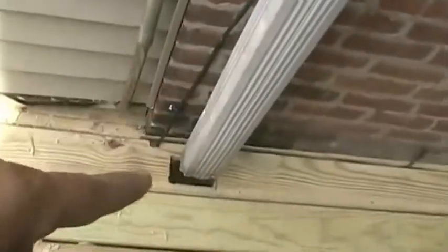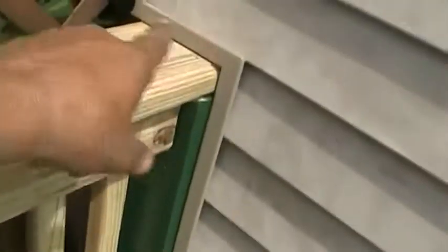You can see the rails are all up, splitting between the two neighbors — it's all screwed down. We put our last piece in. Put our piece over here that goes underneath. Cut out, put in the downspout. Cap is on. New piece of wood and lumber underneath. Siding is back up — we raised the siding up, capped the bottom, capped over here. New J-channel. Our two-by-fours are routed under here. Nice bevel, so we have a nice match-up with our rail. Our rails are routed between.